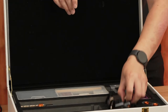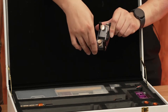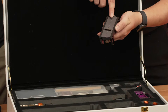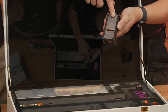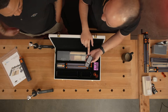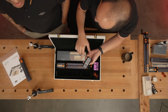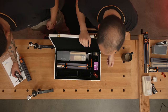Okay. And then this is special. If you've seen this, it's very similar to our HP8. It looks exactly like the block plane, yeah, right? The mini block plane. Correct. This is our HP8 mini block plane. But what we did is we made it a little different on the Pencil Precision. If you make a pencil, you've got to remember there's a piece of lead that we need to install. So this is a groove that allows you to cut that channel to install your lead. So very unique. It's specifically for this. Correct. So don't try to plane anything else with it. Exactly. Don't use this as an HP8 or a little mini block plane, because this one will specifically make a groove into your piece of wood. Nice. Yep. So we'll set that on the side real quick.